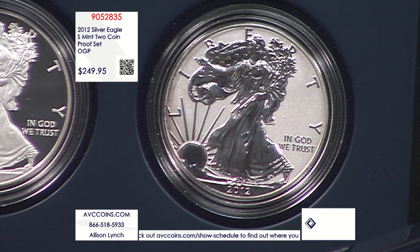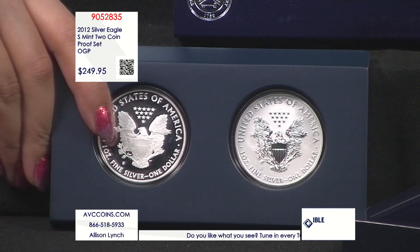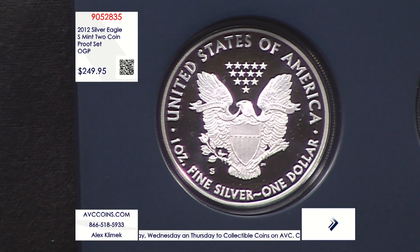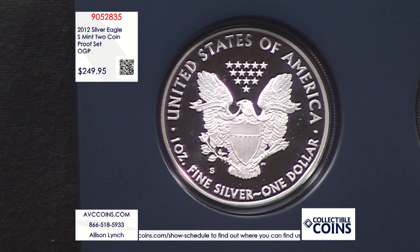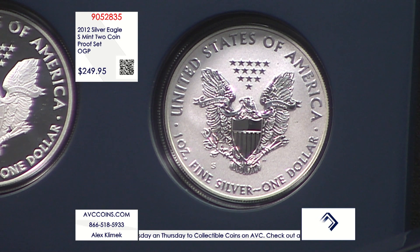We're talking about year 39 with 38 regular issue proofs — the silver eagle for collectors. Proof is a method of manufacture. A regular uncirculated coin gets a single strike, but a proof is a whole different game: the obverse and reverse dies are polished, the planchet is polished, and proof coins are struck twice under enormous pressure. Since the mid-1980s they've used die blasting to create contrasting finishes, giving us both proof and reverse proof coins.